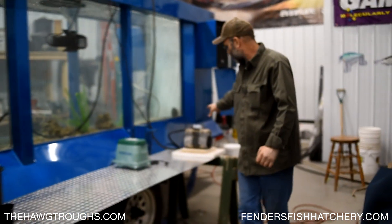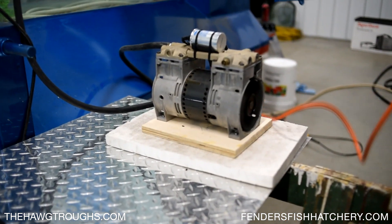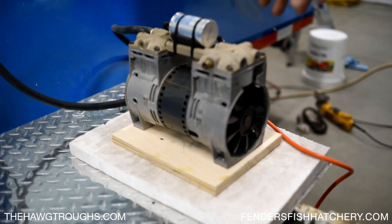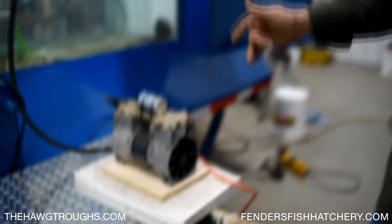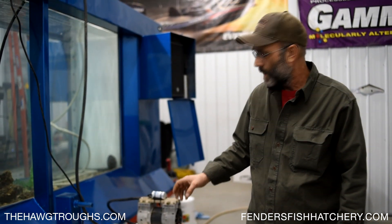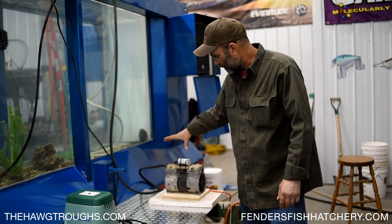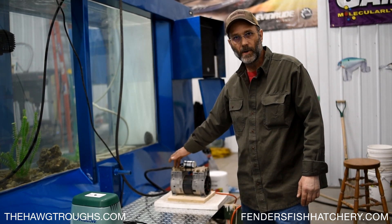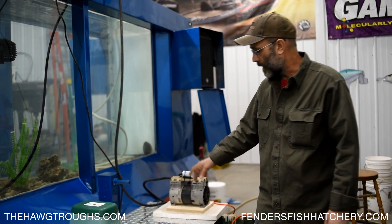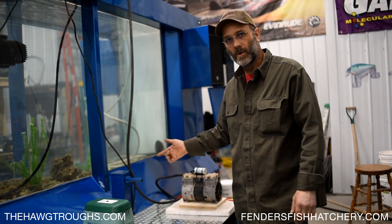The one we have running right now is a Thomas air compressor — a very commonly used compressor in the aeration industry. We sell new ones and used ones. I like the used ones because I have a company that rebuilt some for me, gives a one-year warranty, and these things will run for years and years. It's an electric motor and will run practically forever. The rebuildable parts inside are a little piston-type setup with an O-ring and some reed valves — for about 25 bucks you can rebuild these units. I suggest customers set these on a timer, run them two to three hours a day — it cuts down electric usage and also keeps the pump working longer.